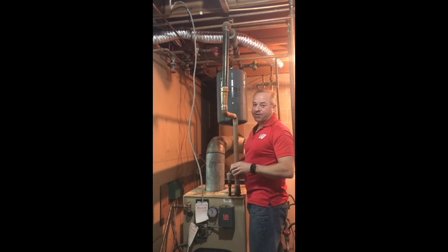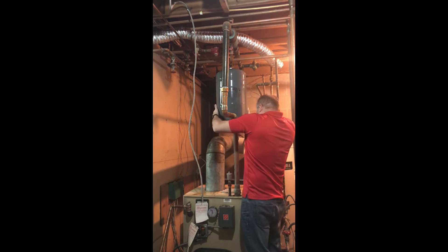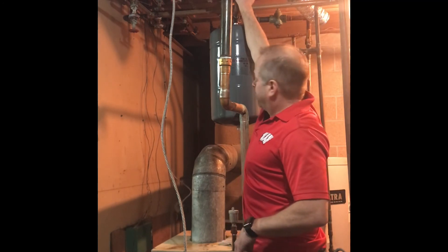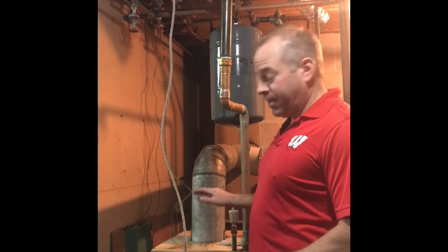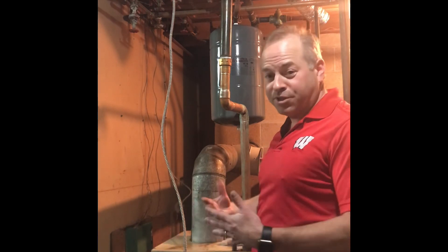The last one was pretty tight. I'm just going to leave this one hand tight — it's pretty firm. The system looks good. Now I'm going to turn the water back on to pressurize the tank. Now it's reconnected to the system. I'm going to turn the boiler back on and monitor this to see if I've solved my pressure relief valve releasing water problem.